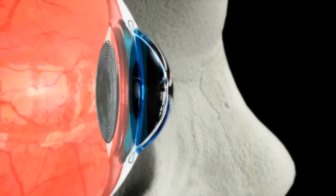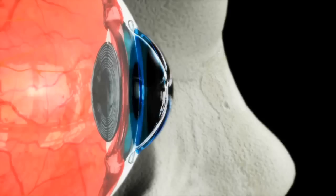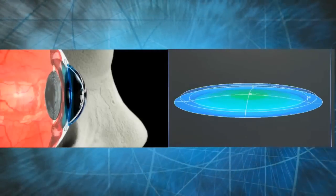Adaptive zoom is a revolutionary method of accomplishing true optical zoom by varying the focal length of the optical elements. The muscles around the human eye change the shape of the lens to change the focal length from far to near. Razor uses polymer in a similar fashion. This is a simulation of the deflection of the polymer membrane under actuation. By changing the radius of curvature of these lenses with a small actuation displacement of a plunger, we're able to realize a fairly large change in focal length, allowing us to create a riflescope system with dynamic zoom.